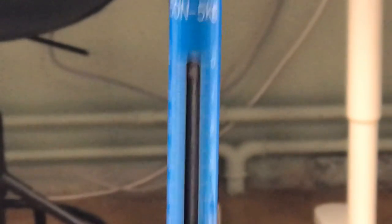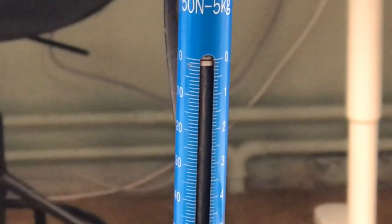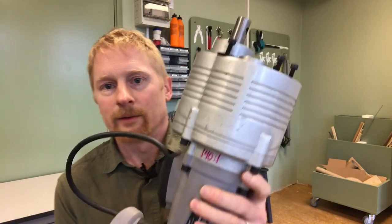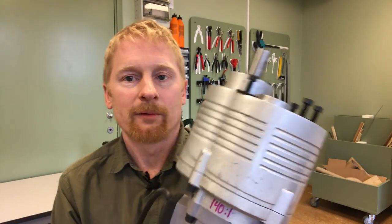Right now I'm hacking a broken corded electric drill. I took measurements from this modified drill — I wanted to see how much torque it could output, how much current it draws, and at what voltage. I want to find out if it is viable to rebuild a typical series wound motor in a power tool to a permanent magnet DC motor, because I'd like to be able to use an earth drill — the kind you use to drill holes in the ground to put poles for a fence.